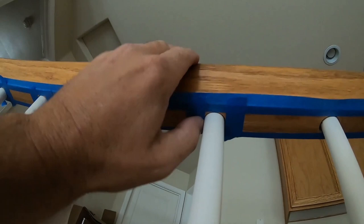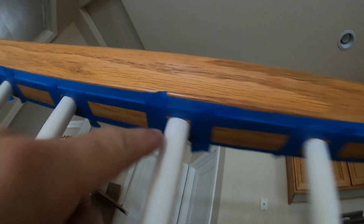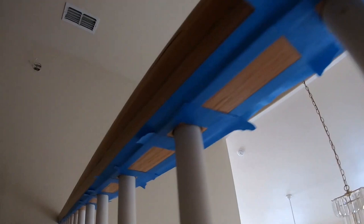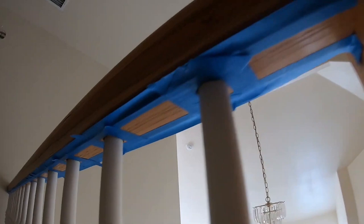We don't want that. Make sure you're just about a chin hair away from the actual piece that's getting painted. I like to do things in batch processing — do all of the side ones first, and then come back and fill in these little triangular areas that are still exposed. It should look like that when you're done. Then we'll fill up those spots still exposed using a wider tape — probably the inch-and-a-half blue tape — and from there we'll wrap it with paper.